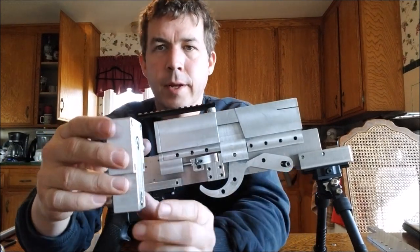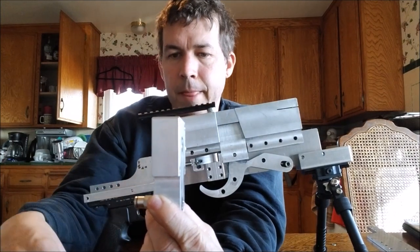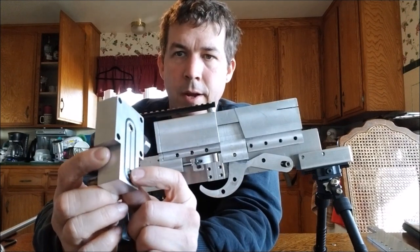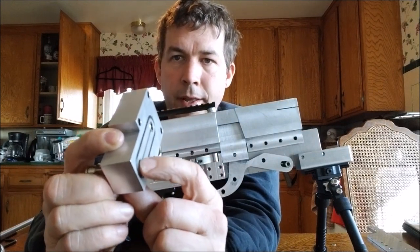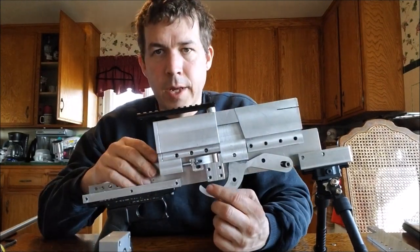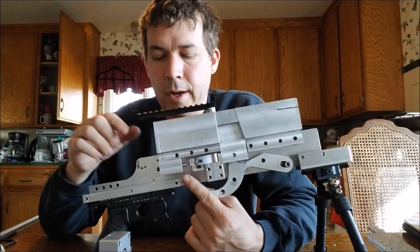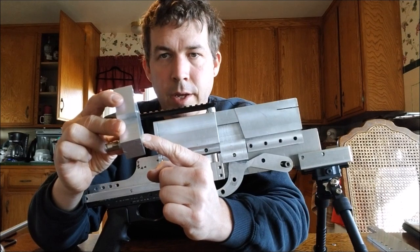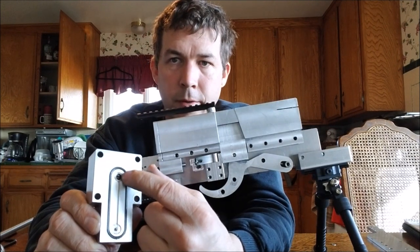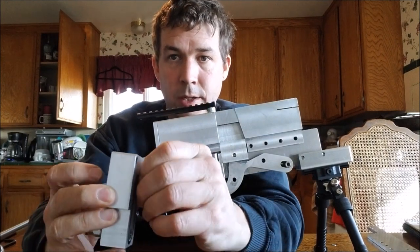With the back portion removed, we can see how this operates. Air comes in through the pipe from the tank, goes through this press-fit fitting, and seals inside this portion of the gun. There's a valve here — you can see the pin — that's sprung forward with a little rubber seal, keeping it closed so air can't pass through unless the pin is pushed. The side lever we saw earlier pushes this pin here, sticking it out into the high-pressure zone, allowing air to vent through. The air travels around the pin and up through a small channel.